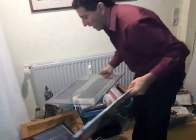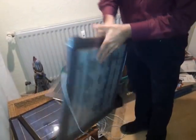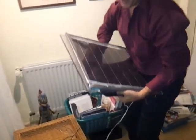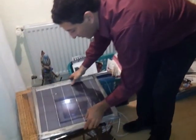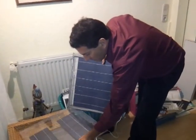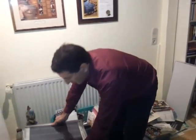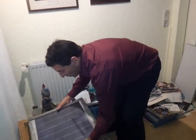This one is a 30-watt panel, and you can see we just solder them together on the back. We've made little ones like this too. When I carry these out in the field — I've taken these to Nepal — they don't break because it's plexiglass. When I put them all together in the sun and wire them, I have here about 20, 40, 60, almost 80 watts of panels. It's equivalent to one big panel, but I can carry them — I actually carried these in a backpack throughout Nepal. So you make your own, whatever size you want.